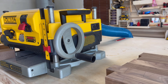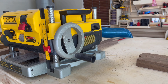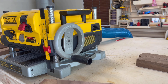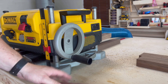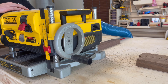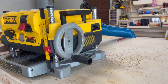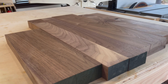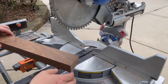To finish off the milling process I run each of the boards through the thickness planer until every board has had material taken off of it. To make sure this is happening, I've lightly marked the tops of each board with a pencil and continue running them through the planer until all the pencil marks are gone. When you do this properly you're left with a series of boards that have the exact same height and, because you've jointed and ripped them with the table saw, they mate up to one another perfectly.